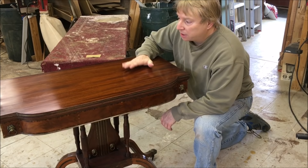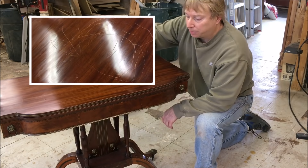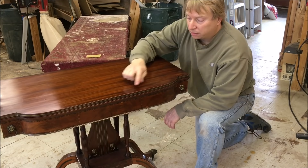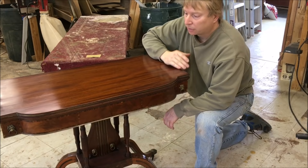Okay, that's it for this one - just a quick repair on this top, took a few days to do. As you recall there were some deep scratches right here from a lamp or something sitting and turning on the surface. I was successfully able to fill in the scratches, first by cutting back the finish and then doing successive coats of spray in this area, cutting it back, another coat of spray, cutting it back again, and keeping doing that until the scratches are completely filled.